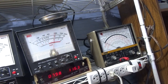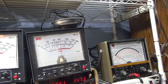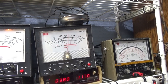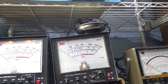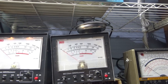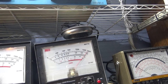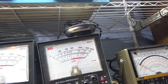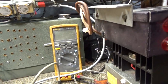With the amp on, we're dead keying about 25 watts. On audio we're talking about 70 watts average, listening to about 130 or so — and again that's average with a lot of swing on these. On peak, we're talking about 190 watts peak. Again, that's with just 3 watts going into it. I could dial up the dead key a little more but I like to keep it low.